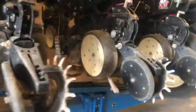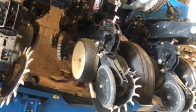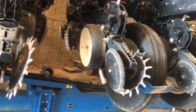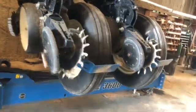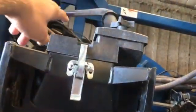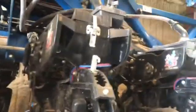But anyway, that's one reason we're getting rid of this planter. Another reason is the simplicity, like I said, of changing between corn and beans. If you plant corn and the corn ground gets too wet, and you want to go plant beans, you have to spend like 3 to 5 days planting over, taking all the seed tubes out, unclamping them, pulling them out, untying the hoses, letting down all the bean knobs manually, and putting all the plates in them and everything.